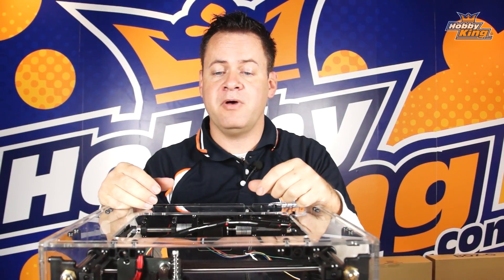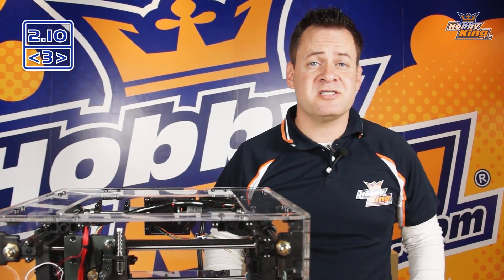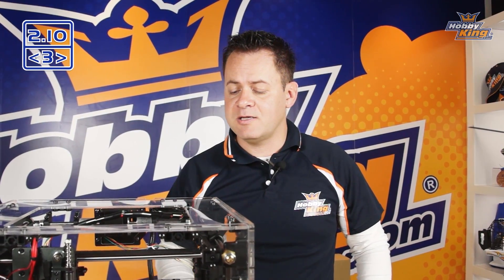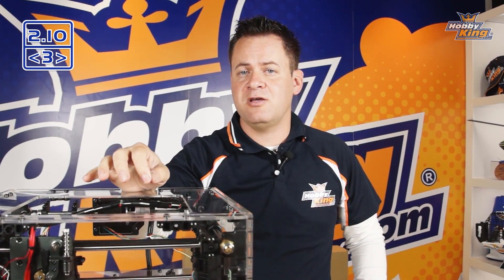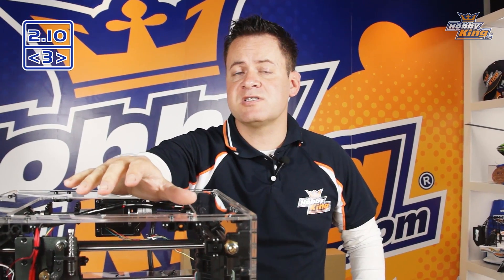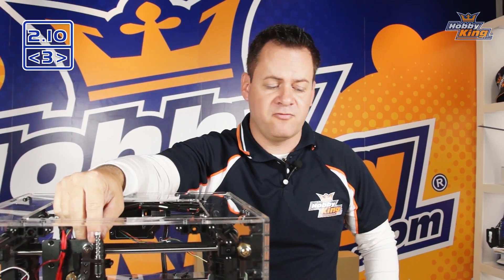Let's go ahead and move to our upper mount for our spool. That brings us to step 210.3 in the manual, which is our upper frame for our spool. This is a top-load spool. A lot of printers out there have a back, side, or even underneath spool, which normally requires a separate motor to drive filament up to the top. On cheaper ones without those motors, a lot of times when the filament is pulled it's under a lot of tension and you actually get skip steps on your extruder and the filament could even break. Top load is the easiest and best — it's direct, just comes off the spool and straight on down. It's high enough that it's got plenty of articulation so it doesn't stress the filament as it goes in, and we've found it to be the absolute most reliable way to load filament into the extruder.